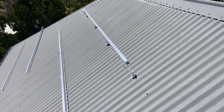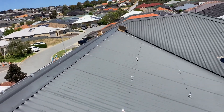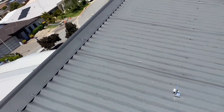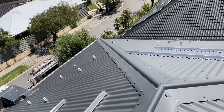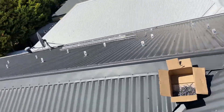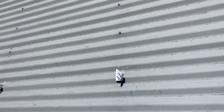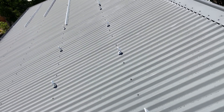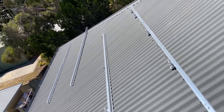I've gone down, cut my rails, and marked them with the measurement and the row they're for. The rest of that row will be one full length of 4.6. I'll use a rail splice to join them — that's the joiner for the rails. Now the tin feet, or interface brackets — these are them here. Depending on where you are in the world, refer to the installation instructions for the rail manufacturer, which will give you the spacings for your tin feet.